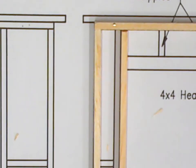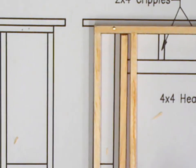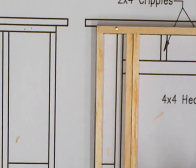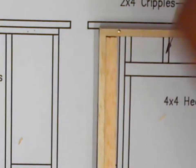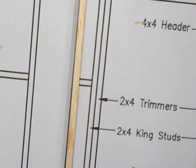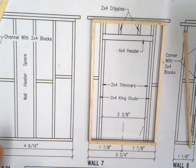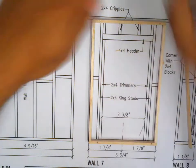Now I'm going to put another piece in that's the right size. Okay, this one will need to be sanded a little bit, but you can see how tight the other piece is next to it. And that is what we want. We want it to be a little snug. So this is a little too snug, so I'm going to sand it just ever so slightly. But if you get that little gap when you're making this, then you really should switch out to some different pieces. So this one, let me double check. Yes.